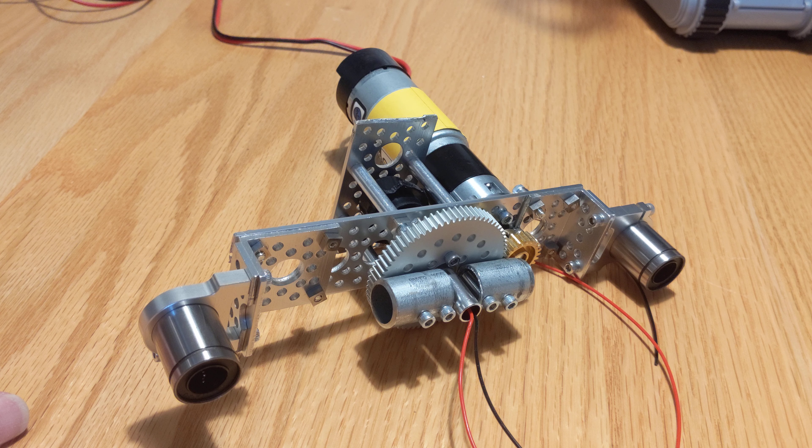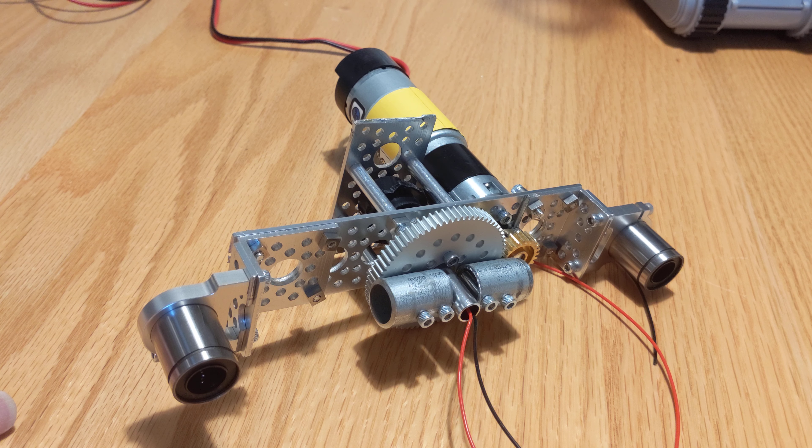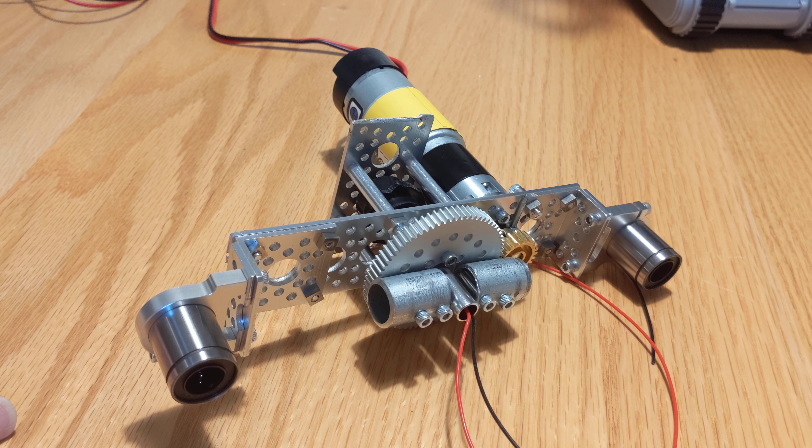Then I moved the motor down into my bracket that I had built to mount the collar and the radar onto the torso, or onto the center support structure. I put the motor there, but the main plate of that was made out of plexiglass, and that also had a little bit too much flex — I just couldn't get a good mesh on the gears.